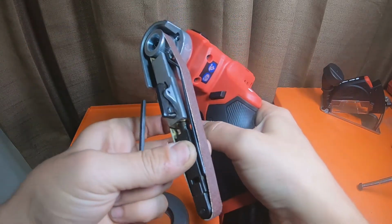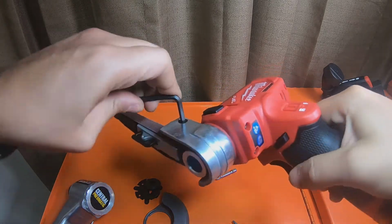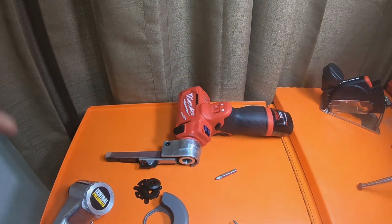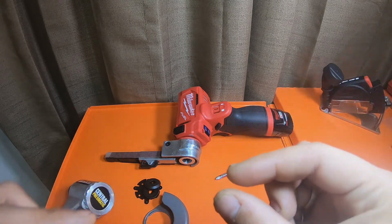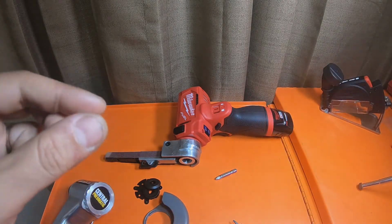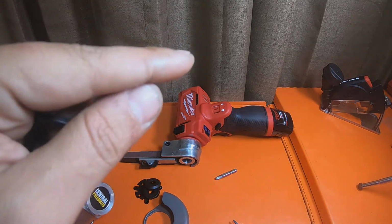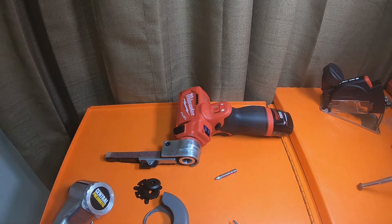The one thing that you guys want to make sure you pay attention to is make sure that you spin the screws that hold the plate. You spin those screws counterclockwise, like you're going to take them out, until you feel it drop in. And when it drops in, the thread on the screw drops into its original hole, the way it was meant to be. You'll feel it drop in slightly with the screwdriver. And then go ahead and start tightening. That way you make sure that the start of the thread on the bottom of the screw lines up with the start of the thread in the hole. That would be my only advice.